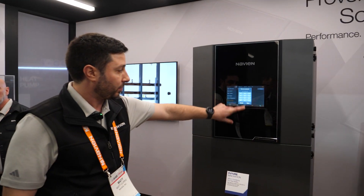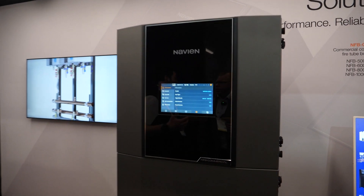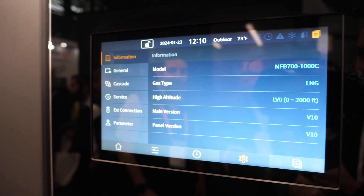This unit does heating as well as domestic hot water, as we can see on the screen. How are you doing the domestic hot water in this unit? I'd recommend doing it through an indirect tank — especially when you're looking at a million BTUs, we want to make sure we've got enough Delta T. So this is just the boiler; you do your domestic like we did traditionally with an indirect. I would prefer an indirect if possible, especially for commercial — it makes a lot of sense. That is a cool looking unit — it looks like a space-age refrigerator. Maybe we should start calling it the Navien fridge.